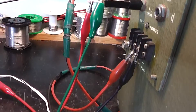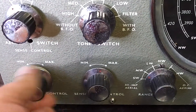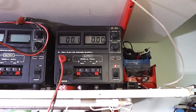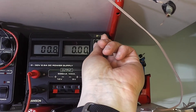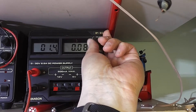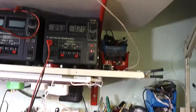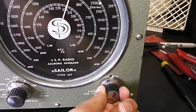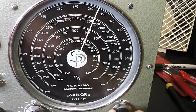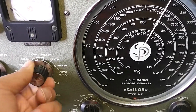I've rigged the side to make sure the polarity is right, clicked the switch a couple of times to make sure it's clean. Set the power supply with a current limit of 150mA and now I'm just going to bring it up gradually over a period of time and see what happens. That's quite a current draw — 1.4V, I think I'll leave it there for a little while. I've reached 5.5V and there's 200mA being drawn. I'm not going to go any higher. It's possible that the push-pull lamps aren't working, so there may be lamps in circuit as well, but there does seem to be some audio amplifier life, which is good.